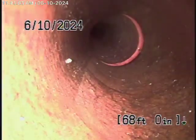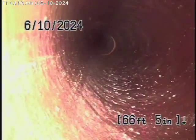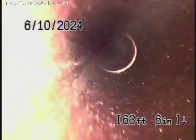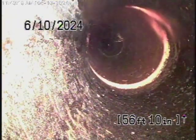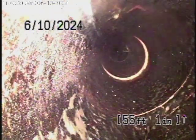That can easily be cleaned out periodically, but the sewer line has an unbelievable grade going downhill, so that's definitely a plus. So we're definitely going to recommend that a clean out be installed where the pipe exits the house. You're obviously going to need to get a plumber over here to just make sure that the grading of the piping underneath the house is all okay, and what that little piece of pipe sticking into the sewer line underneath the house is. You'll see that the sewer line has some minor little roots in it, minor little cracks, nothing serious.